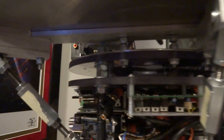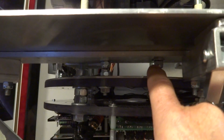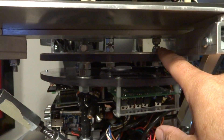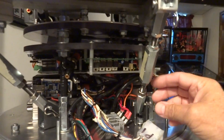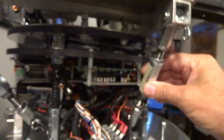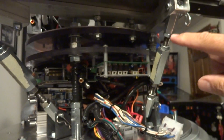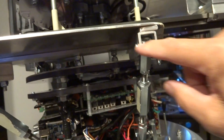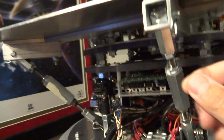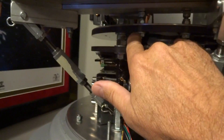For underneath, there's a couple of spacers that I have built in there going through the CSS shelves that actually give me my height every time. If I take it out, these will always be set — I won't ever have to worry about it being in proper level again. And then I have these turnbuckles I made. They're home-built out of sleeve nuts, right and left threaded nuts, right and left threaded couplings, and bolts. I've got them in place with pins and cotter keys. So all you've got to do is pull this out, drop this out of the way — it's detached from here. Take these bolts off, back these off, and the whole thing will slide right out the front.